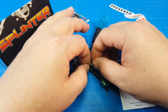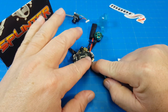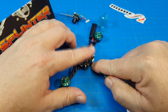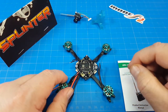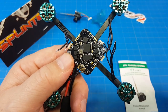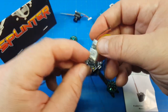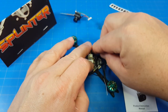Back to the motors — how I trim motor wires is I hold them down, push things over, and do an estimate on my cut. All my wires can reach the furthest pad, and I'm okay with a little extra wire because I plan to use tape right down here to keep them out of harm's way. I've also got my receiver out. The back is here; my receiver connects right up here. Let me hold this up closer — we've got S-Bus on the top pad, a 5-volt, and a ground, which is all I need with my FrSky XSR receiver. I'll position it underneath this canopy and wiggle these wires around, then solder them up.